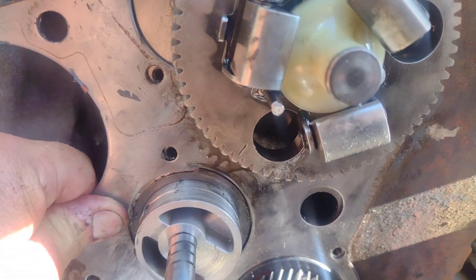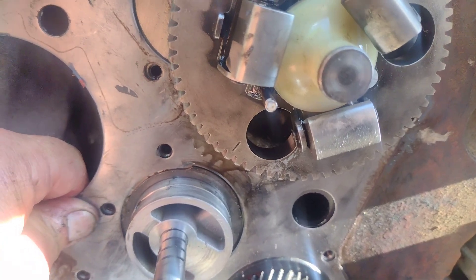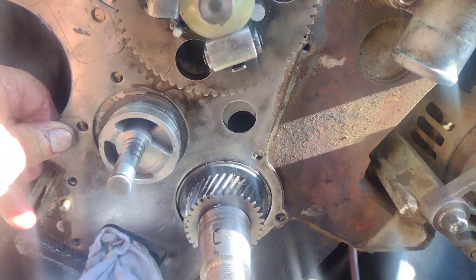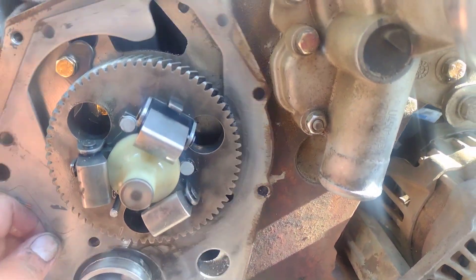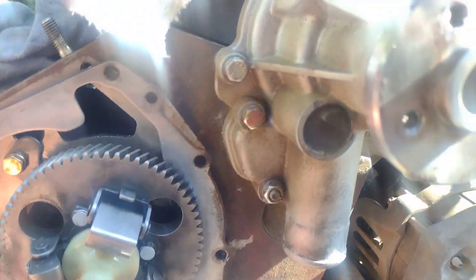That crease is like a 1/16th inch or maybe three millimeter gap, and you can tighten the bolts as hard as you want and it's not going to close — it's going to leak. So they had this thing on and off like four times. I see gasket cement all over the place. The problem with this plate is you can't get it off to clean behind it.